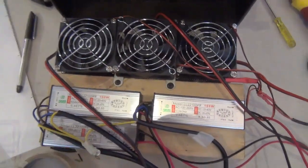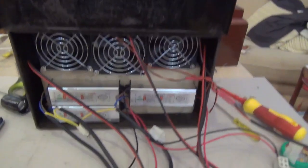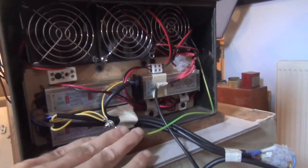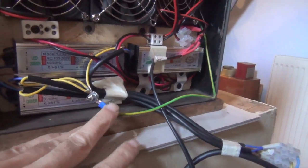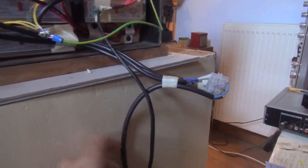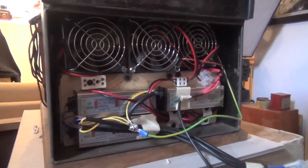The third fan's now fitted, and it does all fit inside. So now to tidy up the wiring. The unit's in there now with the three lamps and the wiring tidied up somewhat. I've added an earth as well. This is safe, but still temporary. There's a ceramic block coming to fit inside, but it's working.